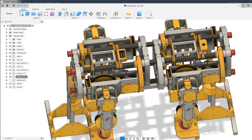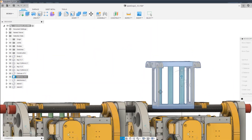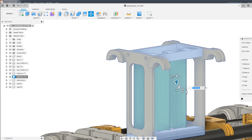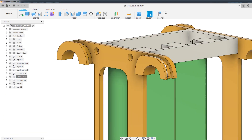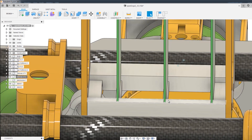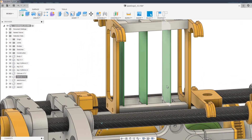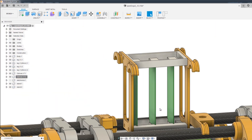There's plenty of clearance there for plenty of things, so it can just be lifted straight out. It's going to be zip tied in using some zip ties around these channels. We've got the three O-Drives in there, and I'm basically squeezing the corner of those boards into a 3D printed rig that's going to drop in, which should give us easy access to all of the connectors.